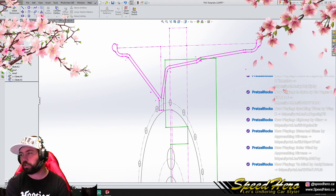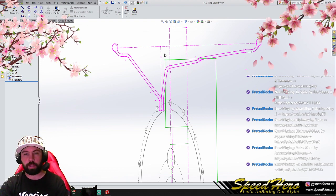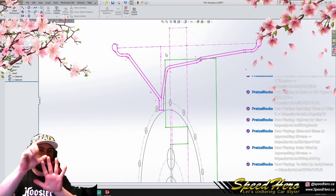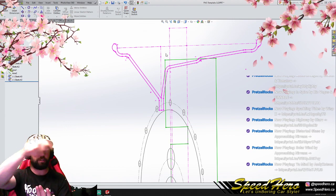We're also going to have to run a really short, small lip, so like a 1-inch wide lip. What I mean by that is from the edge here, where our tire mounts over, it's going to have to be only 1 inch. Where the larger it is, there's kind of a nice window where there's a little bit more strength. A 2.5, great. A 10-inch wide there, probably a little soft. So we want to find a nice window, but one seems a little bit narrow from a radial strength perspective, but also from a torsion strength perspective. Having a 1-inch plate of 3 or 4 millimeter aluminum is very flexy.